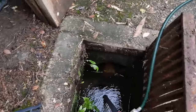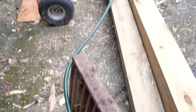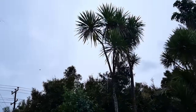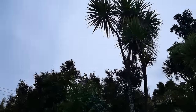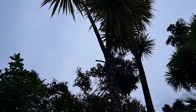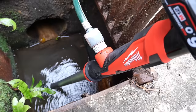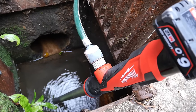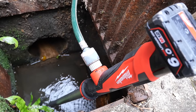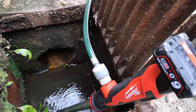There we go — I saw it squirt. Struggling. Is it going to do it? Uh oh, not coming out. Well, I had a few goes but it just squirts and dribbles. So I've measured it and we're over the limit here — we're over 5 metres, especially measured from the inlet rather than the outlet. We're well over the 4.6 metre rating this thing is rated for.